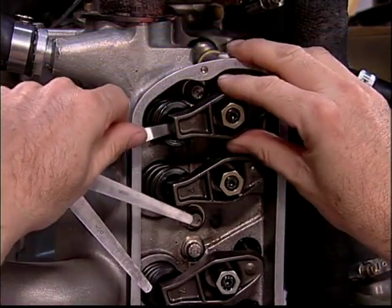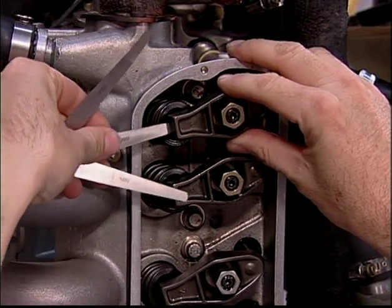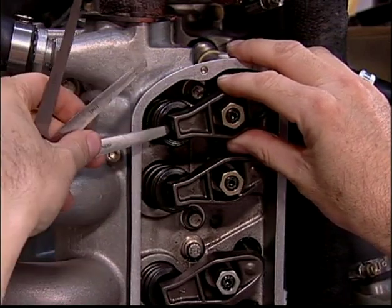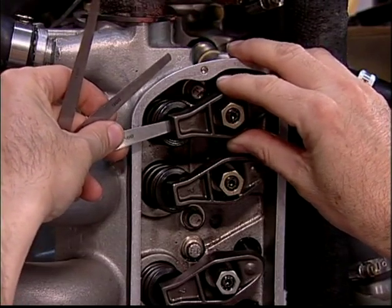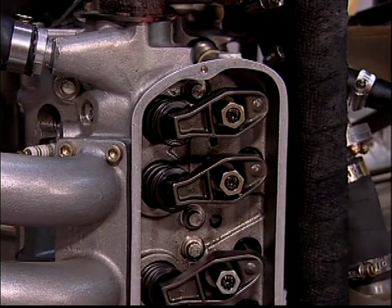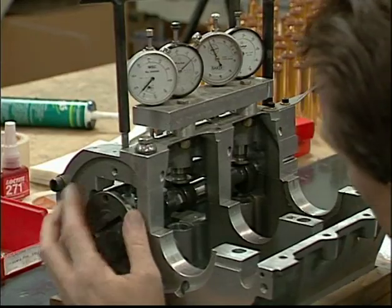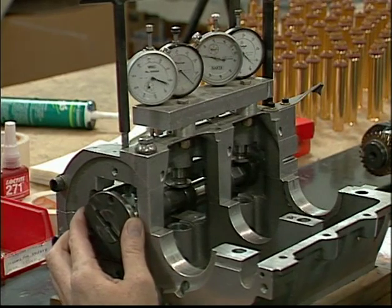Anytime a lash measurement is made and several valves have a lash of more than 8/1000ths of an inch, this is a clear indication that you need to make more regular adjustments. Any lash found in excess of 8/1000ths of an inch warrants further inspection of the corresponding lash cap. Because of the design of the camshaft in the RI-162F engine, it is essential that proper lash be maintained.